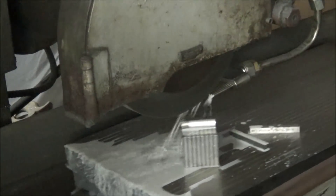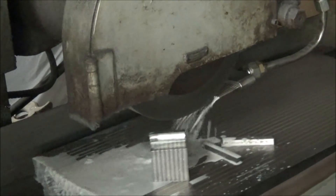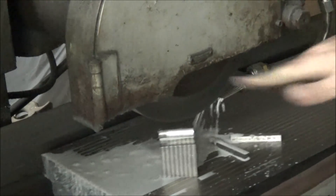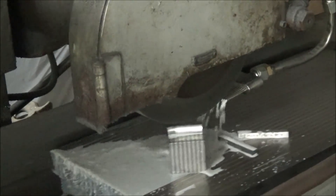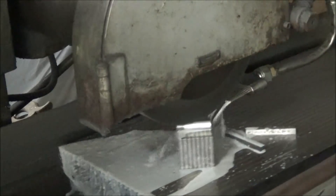Now I'm grinding it flat on the side of my bolt. It's going to go up against the block here, which gives me a nice parallel reference to weld to. I've got it on a little bit of an angle to help keep it from kicking out.